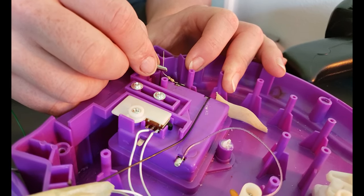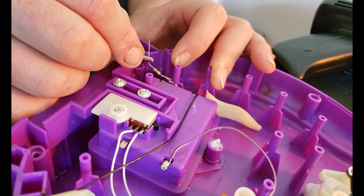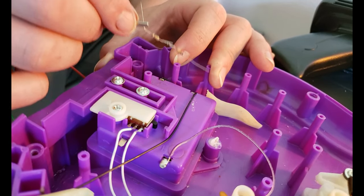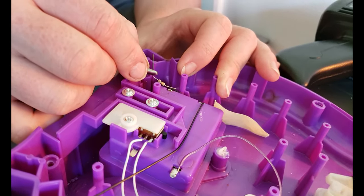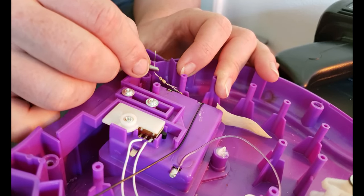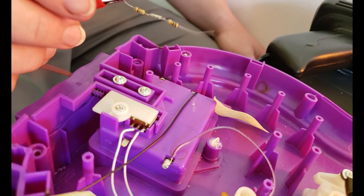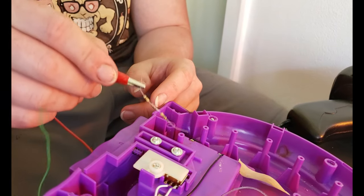All right, so as you can hear, that's not a dead stop. It's really low. So let's pull it off. So yeah, it seems like we'll actually be good right here if we put a 10K resistor on, because we can flip it in and out without any issues whatsoever. So we need a 20K resistance from the median to our higher tone. We need a 10K from our median to the ground.